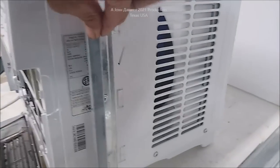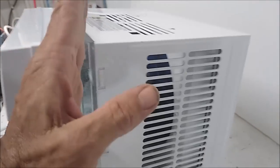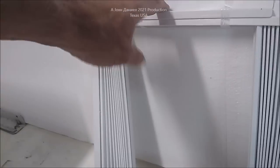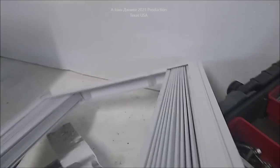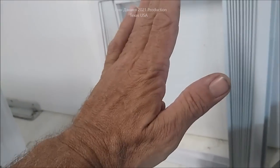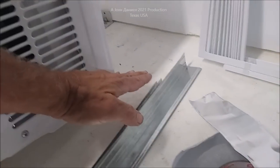Because I want this to slightly tilt back — I want this air conditioner to drop just a little — and that's what these drip edge pieces are designed for. You'll notice the difference in thickness: they're made to do that. This is a quarter to half inch — I think three-eighths of an inch — thicker on one side than the other, to make it lean a little bit, just like you've seen in a window install.